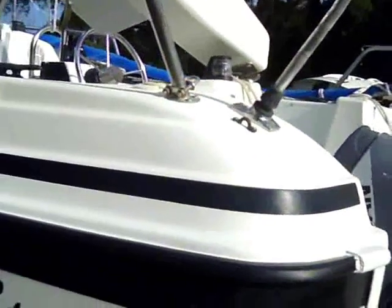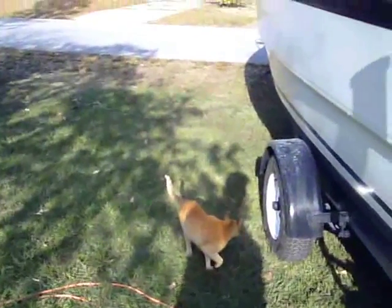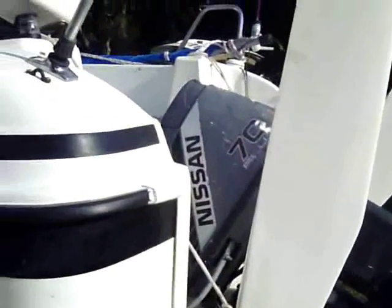So that's the whole big mystery of a rub rail. Rub rail costs about $75 for 50 feet. For a 26M or 26X, there's plenty enough and then some. After you fit it on and stretch it all on the boat, you'll have about 4 feet on either side of excess. And that is that. That concludes the improvement on that.